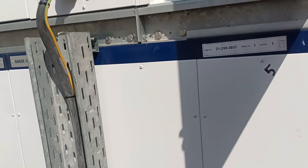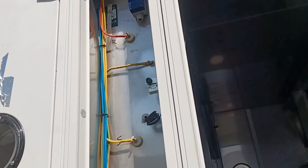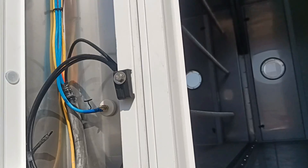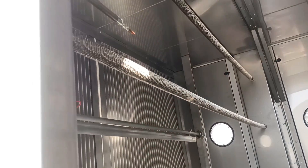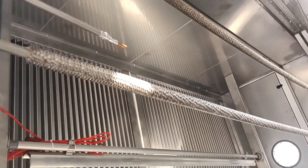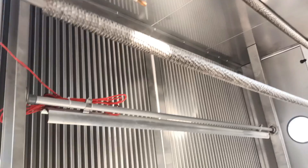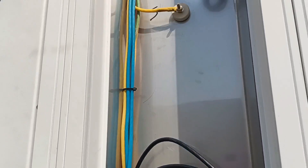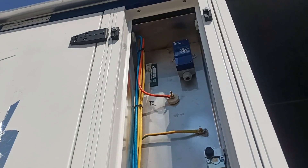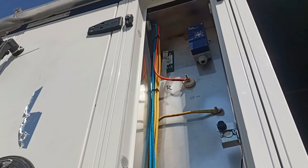We have opened the cabinet of the heater. Now I can show you how it looks inside. Here there are red, yellow, and blue cables — this is a three-phase heater. When the heater generates heat, through this the air will be heated. And there is a tube inside — that tube bulb is the UV light for killing the bacteria. And there is a timer and temperature, but that one we will not use.